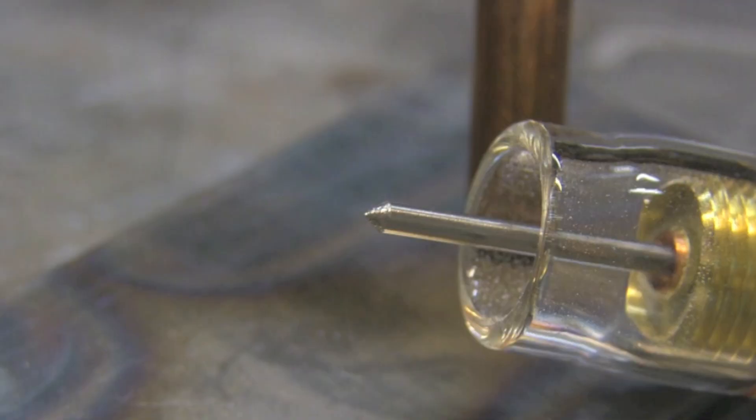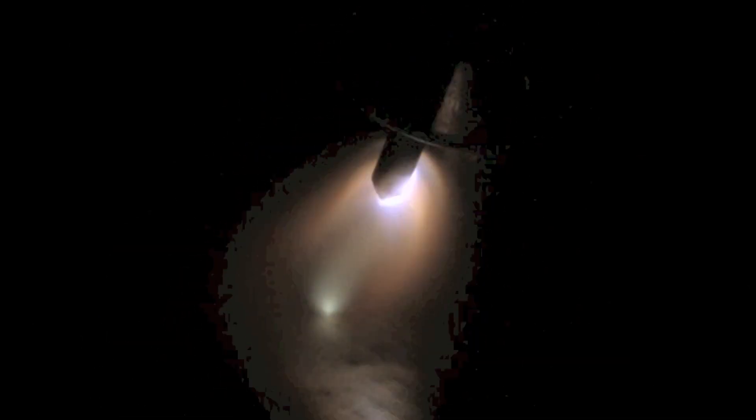I'll show you the wrong way. Coarse scratches running sideways with a blunt tip can really be a problem on arc starts — that arc could wander over to some little thin cooling fin or something next to where you're welding and melt it off. It could be a big problem. Here it is in slow motion, just because I thought it looked cool.